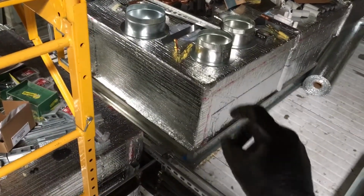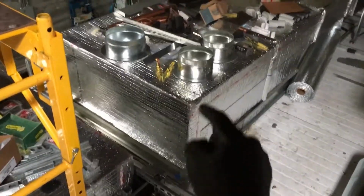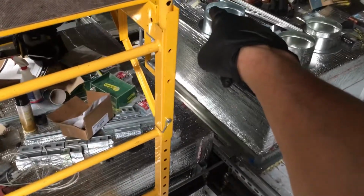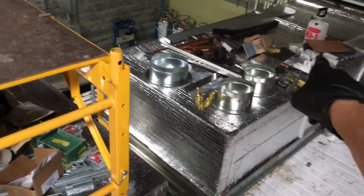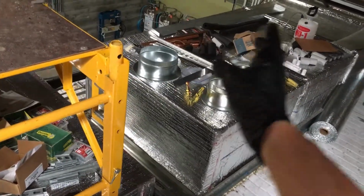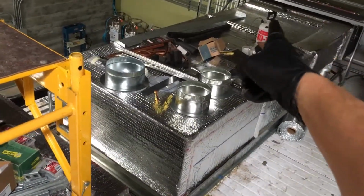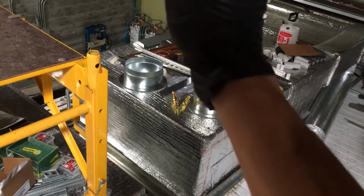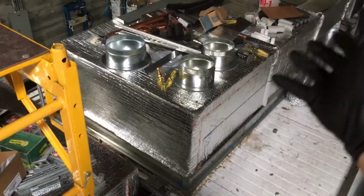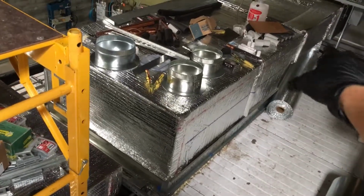They're 5-inch deep MERV 16 filters, and the outdoor air is actually going to feed into the filter box on the side. And the important thing is you have to know where your temperature sensor is, because we're going to have cold air in the wintertime. It's San Francisco. What we call cold is 50-40 degrees.